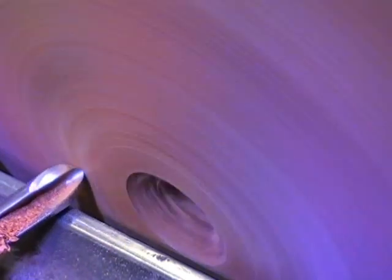I want to come back to this end and clean this up. This has got to be a little curved. So over here, watch the bevel. I'm reading the bevel, I twist it, I open it, and I push on it. If I don't swing my tool handle, I will lose the cut. So here, open the bevel, get a read, push it forward.